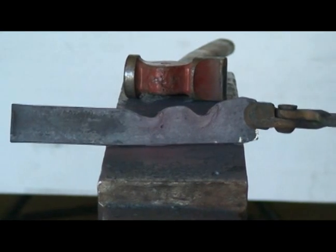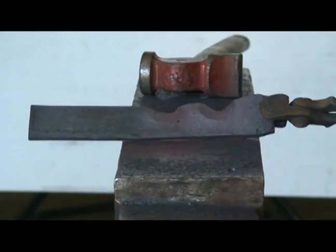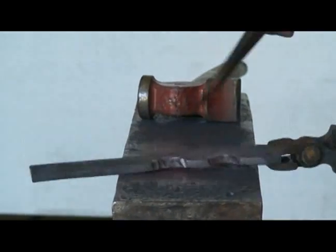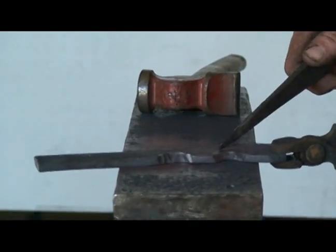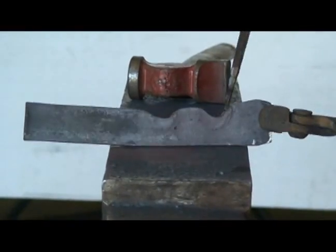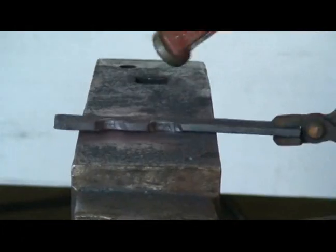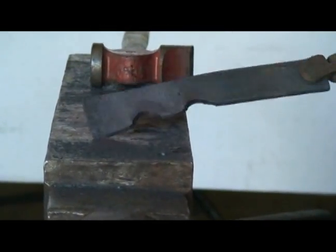So alright, I got my mark. You can see my one mark's right there. And I do it on this side so that this will be the side of the sideweight. I got 2 sides chiseled down. My next heat, I'll make my heel and my trailer and start to bend my quarter around.